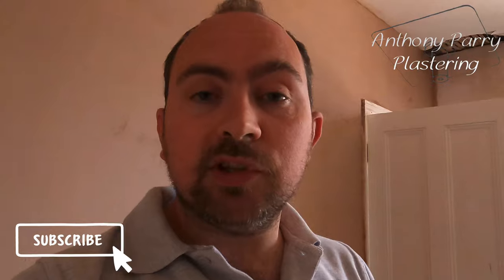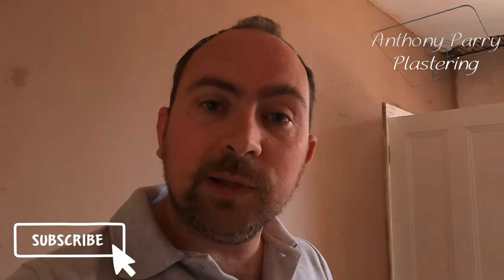One of the other benefits of using blue grit is if you've got any background that's not got a lot of grip, or if you've got lots of different varied backgrounds, it can actually make your set a lot smoother and a better transition. Because sometimes if you've got different backgrounds on a wall, you can get suction in different areas. So let's say, for example, you've got sand cement, bonding, and old plaster all on the same wall. If you put blue grit over it, it would all just pull in at the same time, so that you've not got any dry areas when you're putting the skim on.